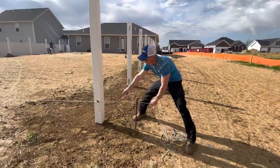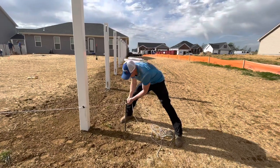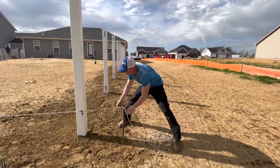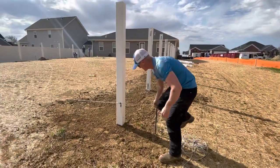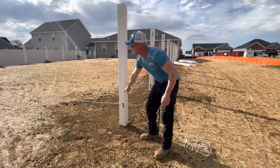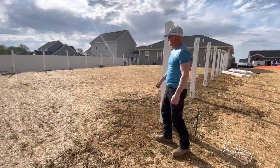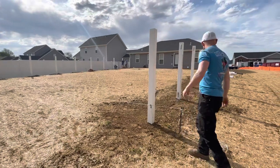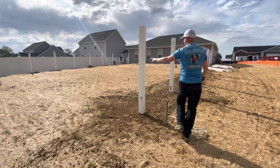Once I have it to the center of the post — like that — I wrap this cord three times and pull it back over top of itself. We're done. Now look at that — this is going to be in the center. Those black tags mark all the rest of the posts. We can use this as a string line. We'll just mid-stake that line — we'll get a stake real quick and mid-stake that.